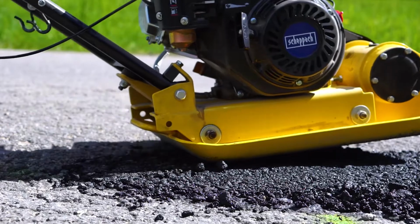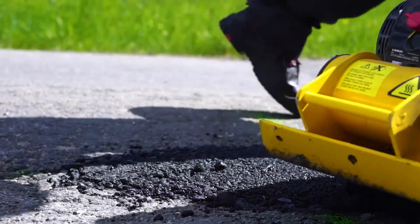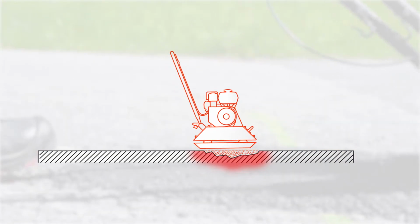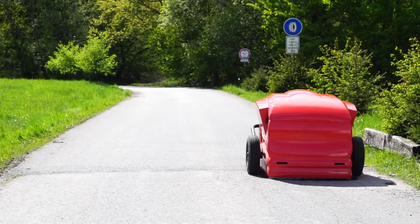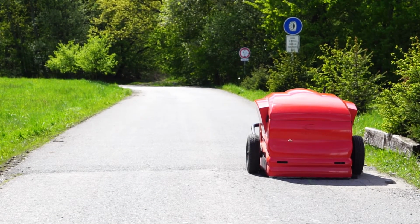Adding melted hot packaged mixture or selected recycled material and its following compaction results in perfect binding with the original surface without transition joints. The technology also includes a boiler to heat up the required volume of the asphalt repair mixture, which is released at the same time as the asphalt surface is heated up.